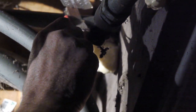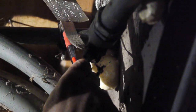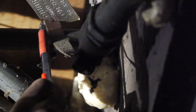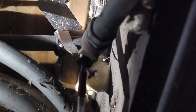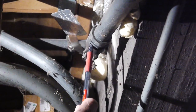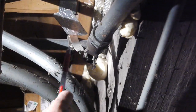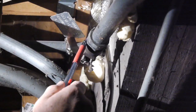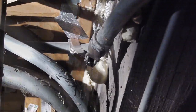The primary components include this clamping device that I am touching with my pen, then the bonding strap which is right along here, and that bonding strap must be connected back to the conduit which goes back to the electrical system. This is our conduit. Without this, there can be electrical current running around the building that could electrocute somebody under unique conditions.